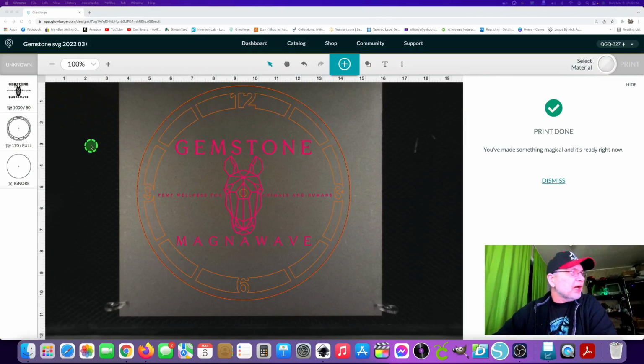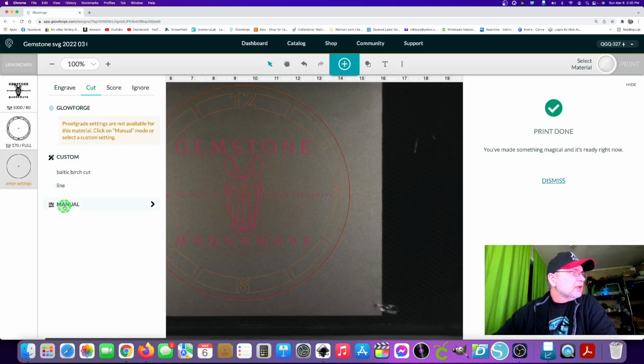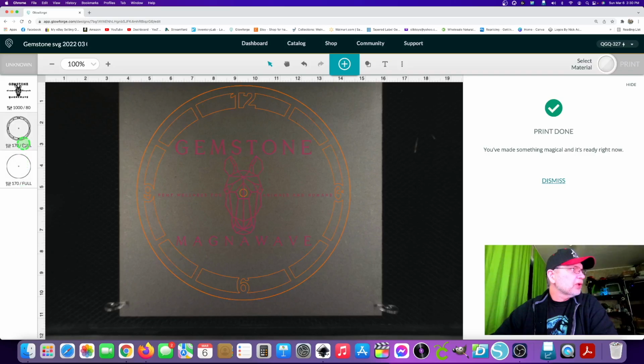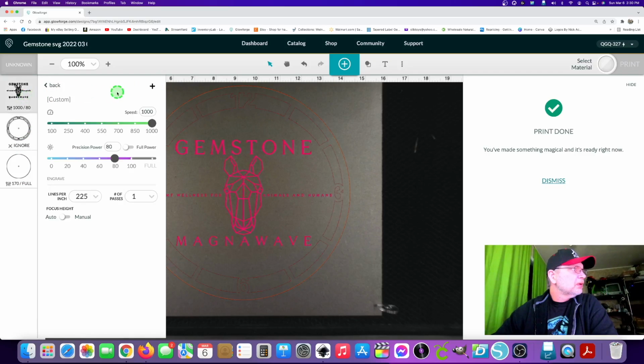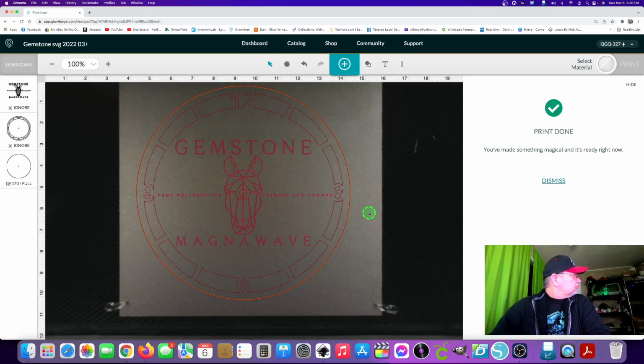So what we need to do now is unignore this one. This one now needs to be a cut. Manual. We're going to go same speed, I think, 170. It never wants to pick 170. And then full power on that. That's good to go. And then we're going to ignore these two. There we go. So all we're doing now is cutting out the MDF circle.